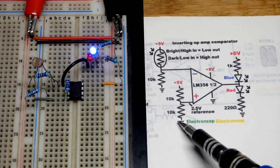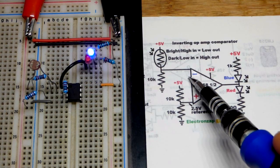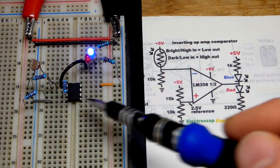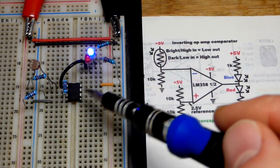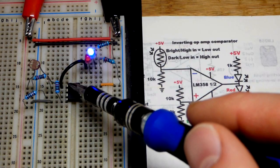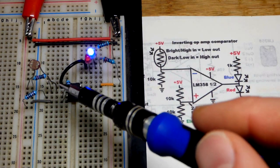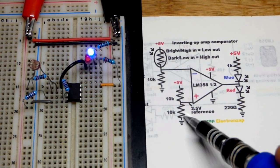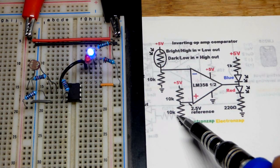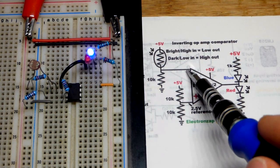I have the pin layout over there but we won't look at that right now just to avoid showing too much at once. We have the minus input there. Always keep in mind on the schematic somebody might draw the plus above the minus, but on the physical LM358 component, the plus is the lower pin and the minus is above it. The output is on top. So: plus, minus, output. Half the supply voltage comes from equal-value resistors — you can set it to whatever voltage you want by adjusting the resistor values.